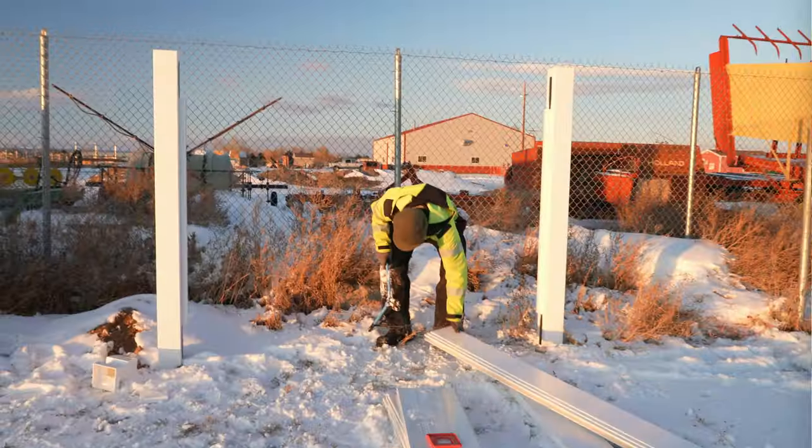When I started installing that, I showed you guys the inside of the rail. Now there's nothing that I'm trying to hide here. I'm not trying to say yours sucks, mine's better, even though I just did. But here is what the inside of our rail looks like. It has 1, 2, 3 ribs. This one holds the bottom. I cannot pull it apart. This is designed to hold the whole entire weight of the section. Now, if you're gonna be doing this, I would recommend a set of sawhorses with some carpet that you could protect your vinyl with to help with scratching and whatever else have you.